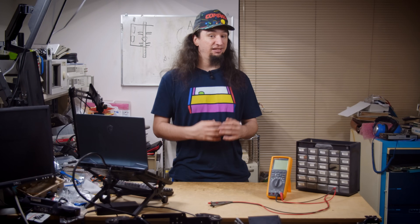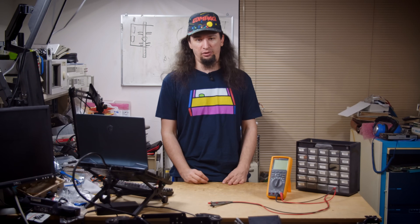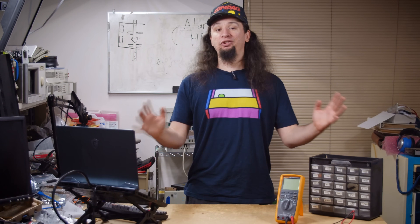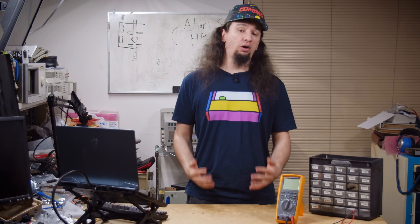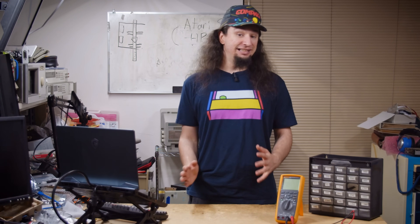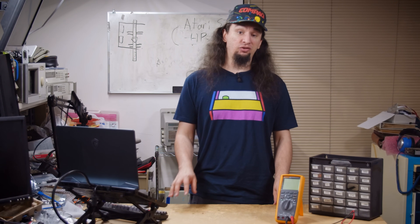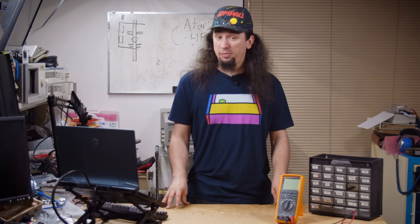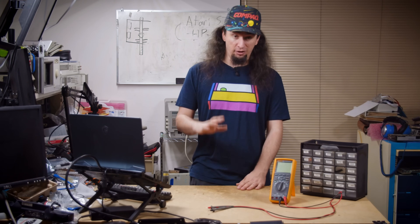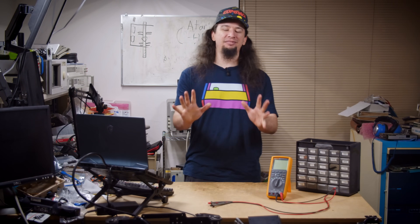Lastly, if you attempt reforming and the capacitor draws a significant amount of continuous current or never has the current reduced down, it's just passed its usable life and has depleted the electrolytic fluid's self-healing capacity — it must be replaced. After all that, I hope those who doubted the reforming process can see that it is worth making an attempt at and it has real outcomes that can help make the capacitors work after long-term storage. It is of course an option to just wholesale replace all capacitors in an older device, but then you have to research suitable replacements, and for these monster capacitors you may be looking at a substantial cost. So I will be reforming capacitors using the methods here, when it makes sense, to help get the older devices I have up and running.